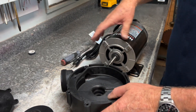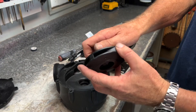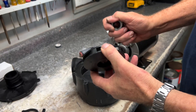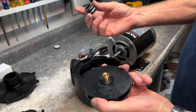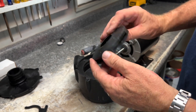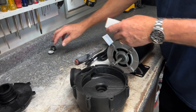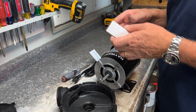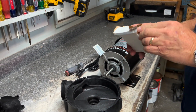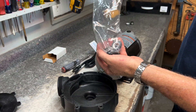We've got that part of the seal. Now we're going to remove the seal off the impeller — take that part of the seal off. Now that that's off we can see it's nice and clean. We want to inspect it, make sure nothing's damaged. Everything looks good, no cracks. We'll set the old seals aside and throw those away.